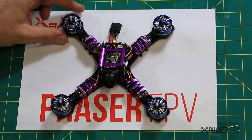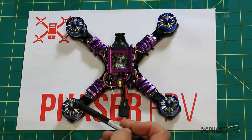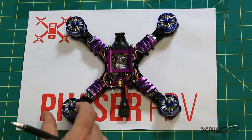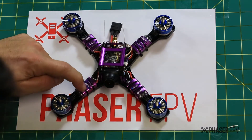You can see straight away they've done a whole lot more effort in making it pretty. First and foremost, new motors upgraded in size and slightly higher in kV — 2306 2450kV motors. Really snazzy looking too, really nice anodizing and machining, and these silver coated wires as well — they look the biz.